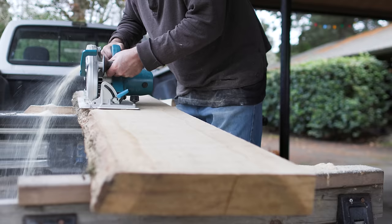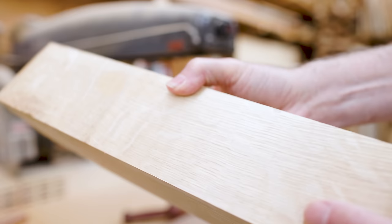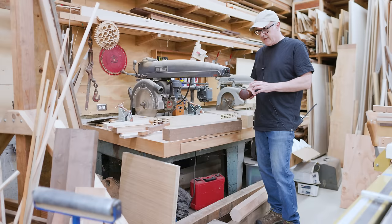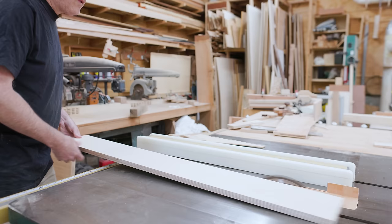The other wood I have for heads is some oak I cut with my friend Trent about two years ago, cut to roughly the dimension I needed for mallets. I checked it with a moisture content meter and it's still at about 16 or 17 percent, which seems a little wet, so I think I'll have to wait at least another year. In the meantime, I'd like to try making segmented heads or purely decorative heads — not something you'd want to hit anything with, but a way to make mallets without the tropical hardwood.